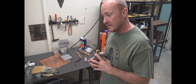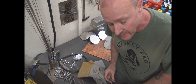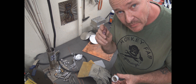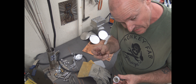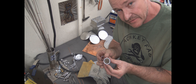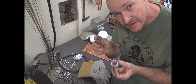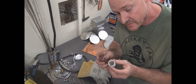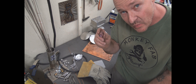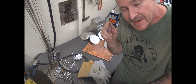So that's the test — we're going to test gas lenses, big cups, and standard cups. In case you didn't know, the numbering system on cups in welding is 16ths of an inch. So a number 8 is half the size of a number 16. The number 16 is one inch and your number 8 is half inch — that's the orifice opening of these guys.